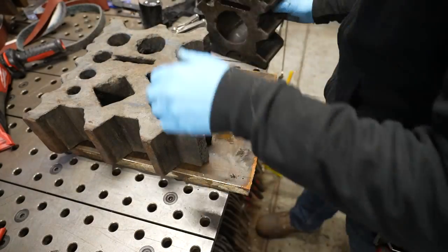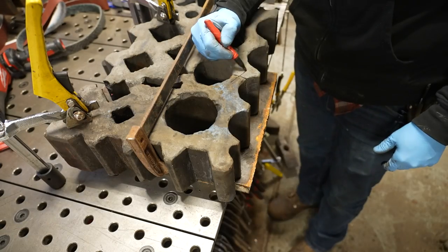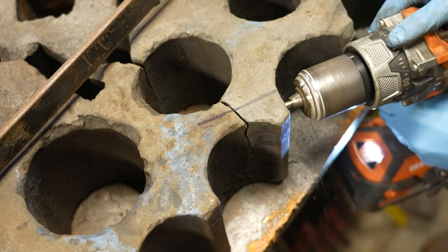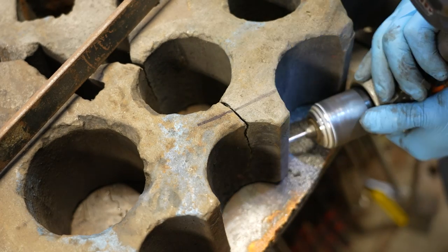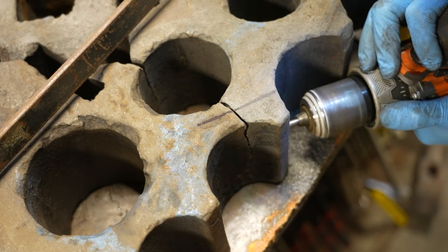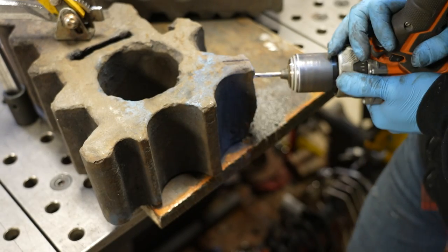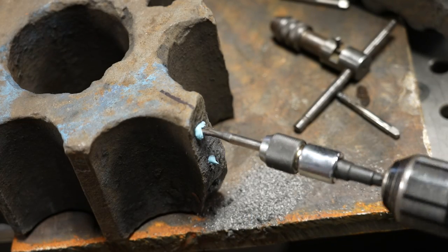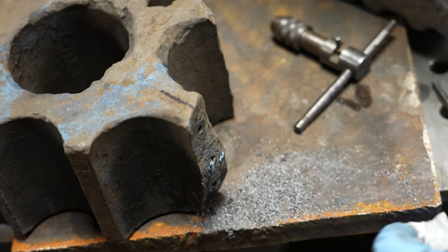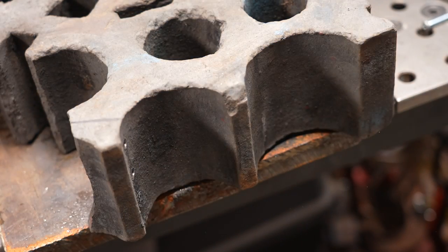You can see the way it fits like a puzzle on one end and there's a gap on the other. On the area where both pieces are touching, I'm going to use some quarter-20 bolts to give some pins and actually help keep this thing together. This is cast iron, and there's always been the recommendation that you should add some mechanical fasteners if possible any time you're trying to weld cast iron. Cast iron welds want to crack, and any mechanical advantage you can give with nuts and bolts can really be helpful. I used a number seven drill bit to drill straight through both pieces and then a tap to tap the holes for some quarter-20 bolts. I have three holes but I'm only going to use two pieces of hardware because I broke my tap in the middle one.